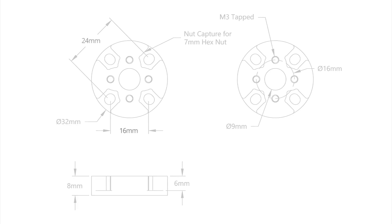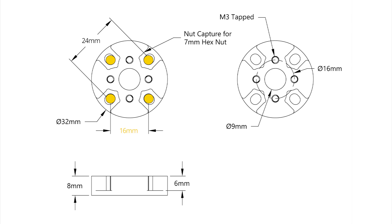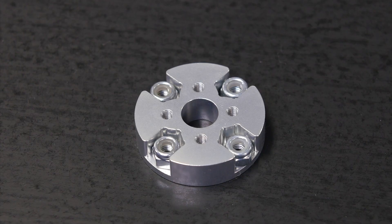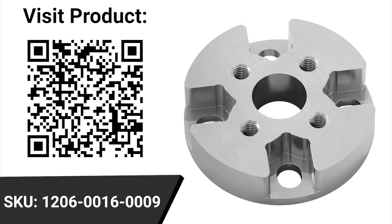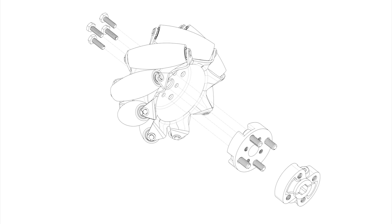The first one we're going to look at has the standard Gobilda 16 millimeter grid pattern, slotted out to the 24 millimeter across pattern. This is a through hole and has 7 millimeter flat-to-flat counterbores that will capture nuts or hex head screws. There are also four tapped M3 holes in the center of this part on a 16 millimeter across pattern. This is very commonly used by Rev Robotics parts, but also by a couple of other building systems. It's especially nice if you're trying to interact with a wheel or another motion component in a Rev system, but want to use a Gobilda hub or mount it to another Gobilda component.